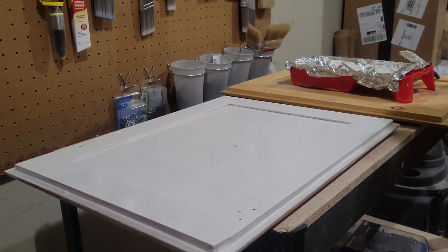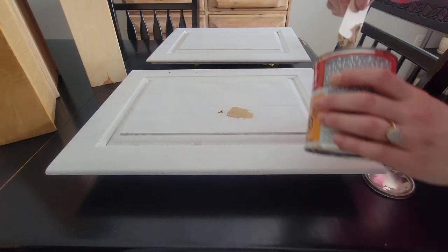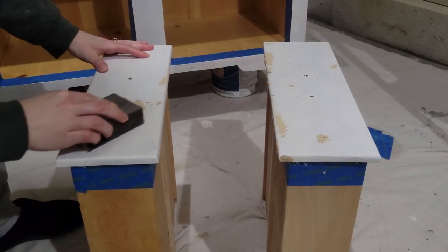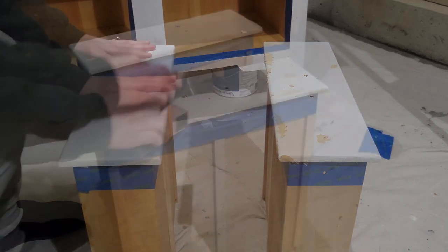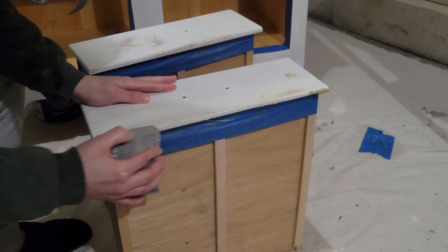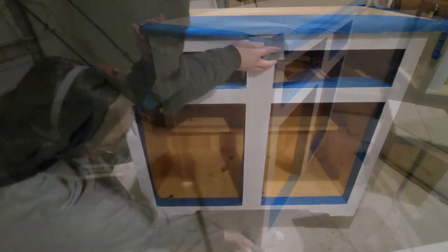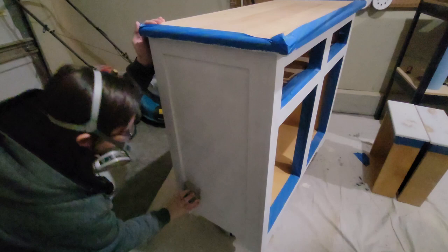There was a huge spot on the back of the door so I'm just taking some wood filler to patch all those spots up. The reason I brought the doors inside is because it's quite cold out in the garage right now and the wood filler would take forever to dry. I didn't have to add nearly as much wood filler to the drawer front so I used a sanding sponge, but for the doors I did have to use my orbital sander with 120 grit. Then to knock down any texture that the roller left with the primer I'm using the sanding sponge again over the entire piece. After sanding you always want to wipe your piece down with a damp rag to get rid of any dust before painting.